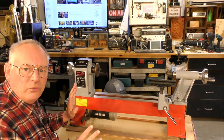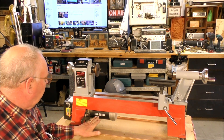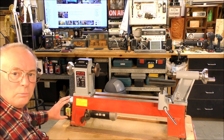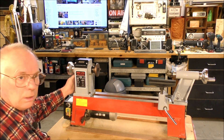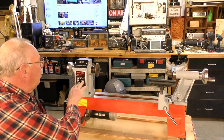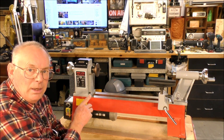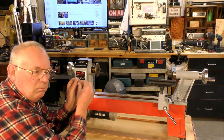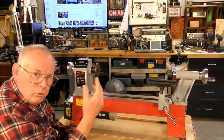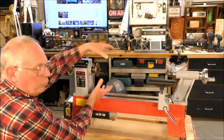This is the most basic and probably the smallest wood lathe I would personally recommend. This particular one is a 550-watt motor. It has a variable speed control, a belt drive inside, and three separate speeds. They go all the way from 650 RPM up to 3800 RPM. You only need the fastest speed for making things like a pen with a wooden shank. For a bowl, about 650 RPM is fine for the size you can get on here.